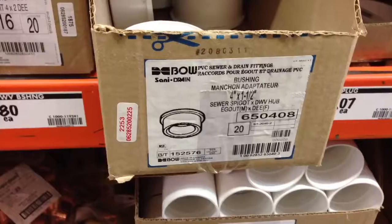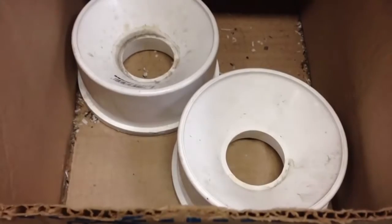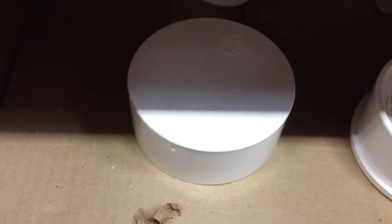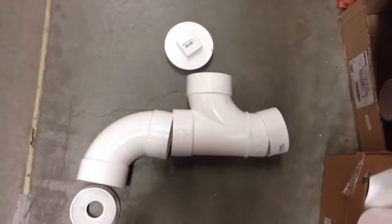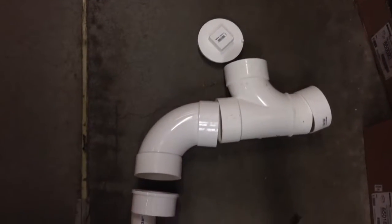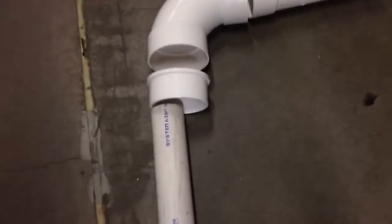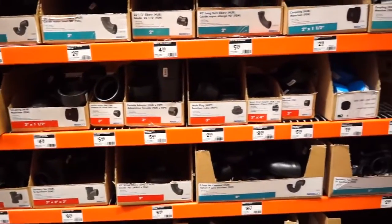Take a look around — I've used four inch fittings, and there's a four inch to two inch reducer you'll need. There's a cap — you'll need one of those. You can start to see the pieces starting to take shape. Lay them out in the store to make sure you've got everything together. Notice the white temporary pipe — I got a clear one a little later on. On the shelf we're going to be looking for some ABS.